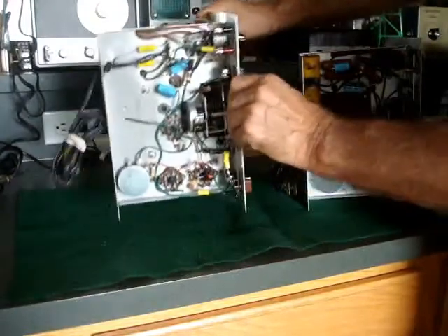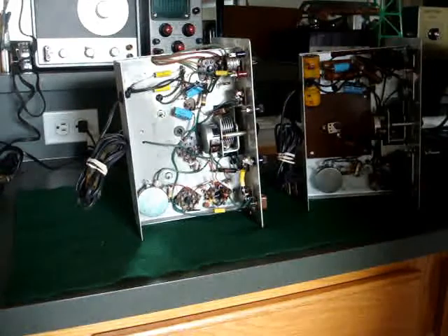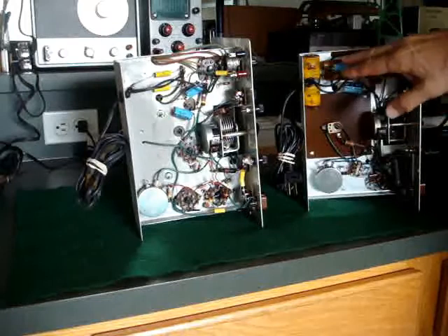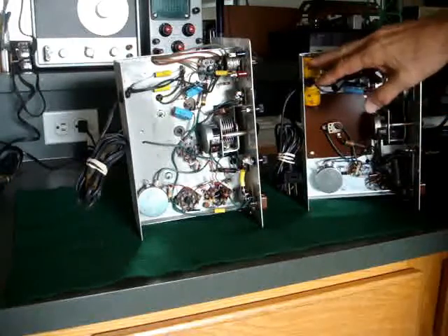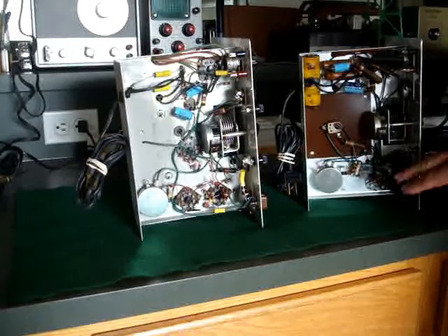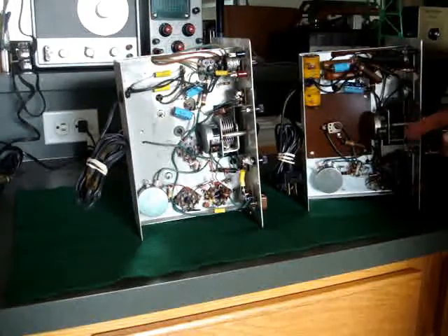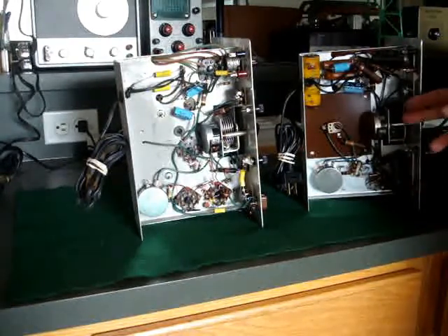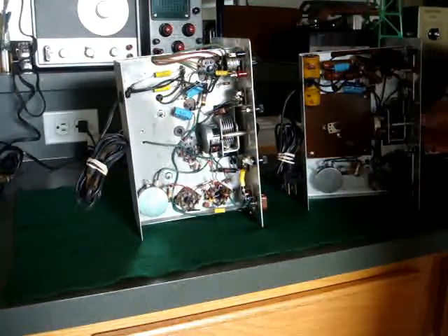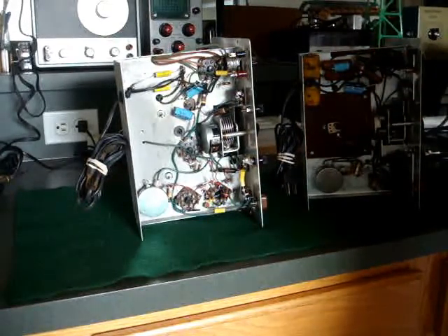I found that kind of interesting, but I like to save these old vintage pieces — they're just sort of nostalgic. This one I have replaced some capacitors; I replaced the filter capacitor with some modern electrolytics, and I have quite a few other capacitors replaced. Some of the resistors in this have changed value — they've increased in value — so I'll have to change those out.